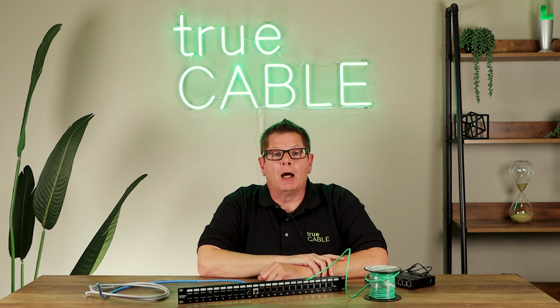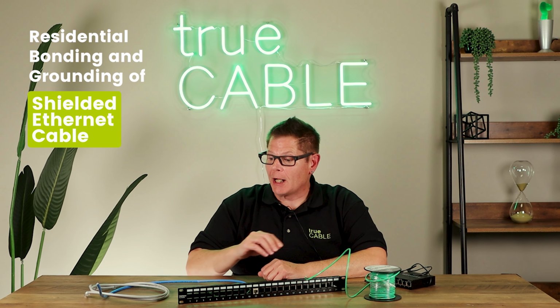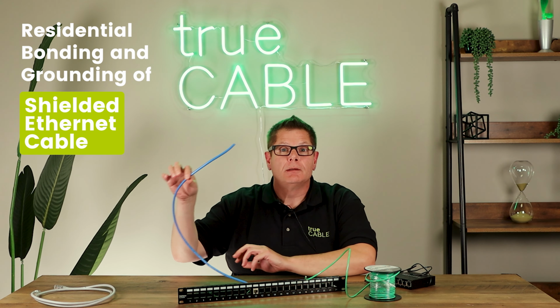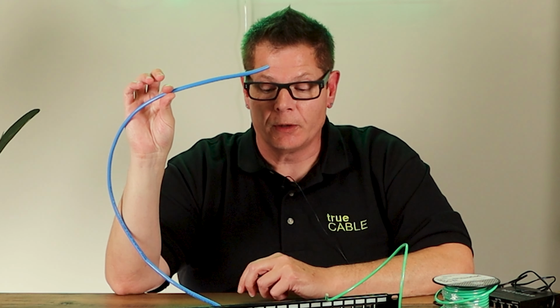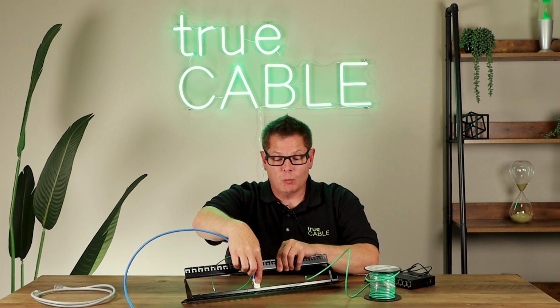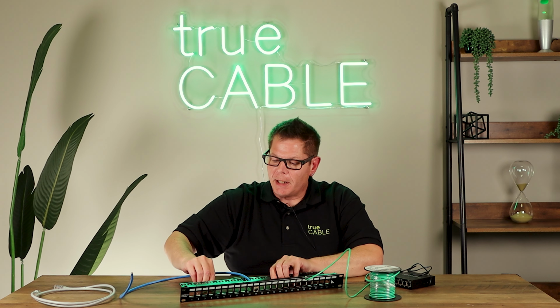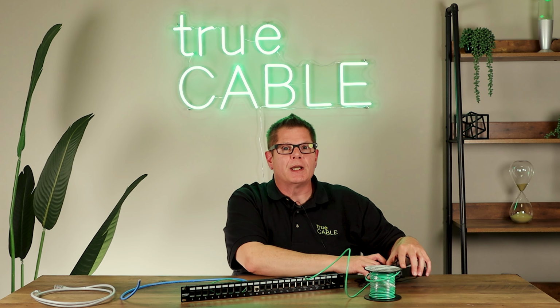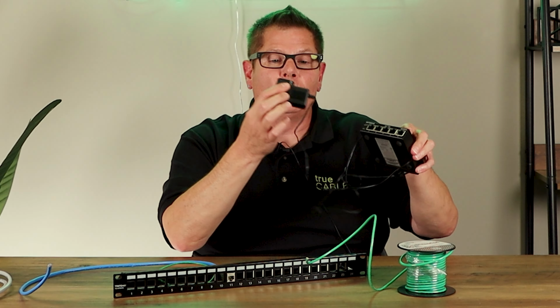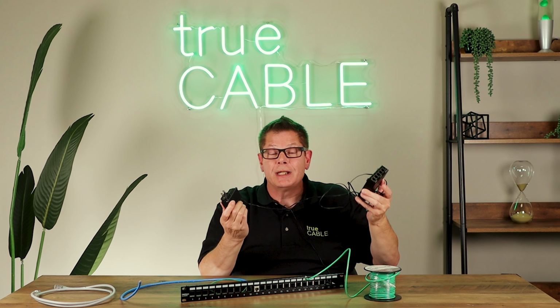Today we're going to talk about a conundrum that many residential homeowners face when it comes to bonding and grounding of their solid copper cable, which is shielded. When you install shielded cable, whether it's residential or commercial, you have to bond the cable shield. You probably already know you need shielded termination hardware to continue the shield bond to the termination hardware. But what if you've got an Ethernet switch that only has a two-prong AC to DC adapter? How do you complete the bond? The answer is you can't.